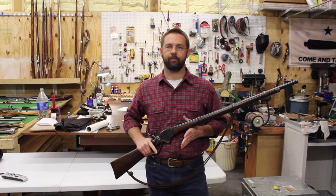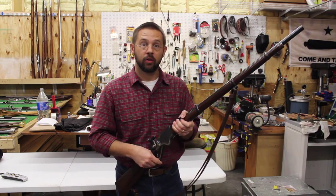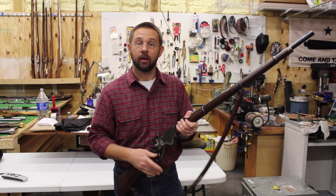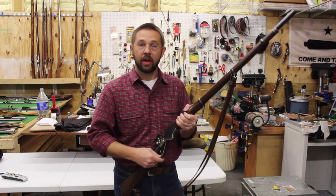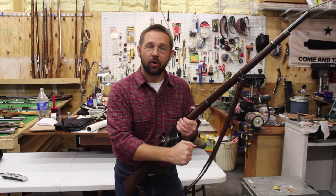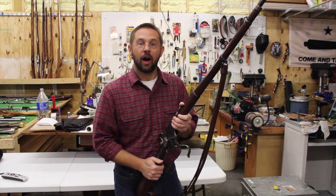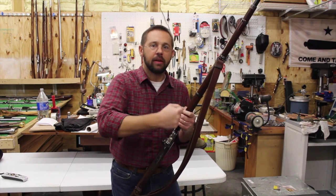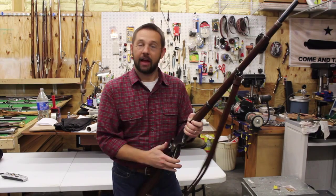Let's talk about some troubleshooting tips. First, cycle the action briskly and enthusiastically, especially when you have seven rounds inside — make it one motion, open and close. Don't stop when you're open and then try to close it, as that makes cycling much harder. Sometimes especially with seven rounds in the magazine, if you open the action and leave it open, you can have a hard time getting the action to close. At that point, try to wiggle it a little bit, or give the lever a bump with your open hand — just a gentle bump, not beating on it — and usually that will overcome whatever is stuck and you'll be able to close the action.